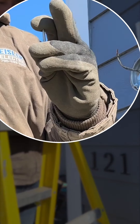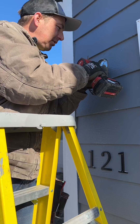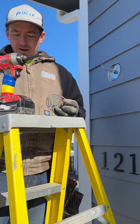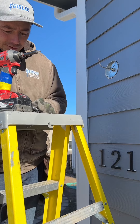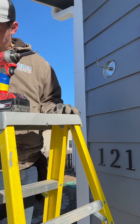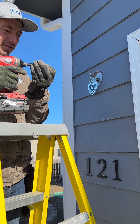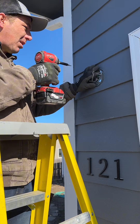Notice I'm using stainless steel screws. Don't ever use drywall screws on outside work. Sometimes you've got to cut these screws off — I know a lot of guys like to run the nut down, but I don't. These are too long, so cut them off. And as you can tell, it lines up perfectly since I had those at a 45. A 45-degree angle will work on any bracket, I promise.